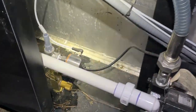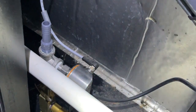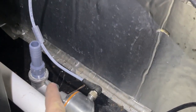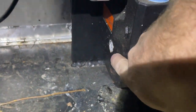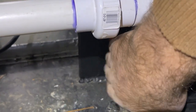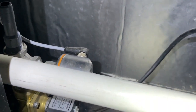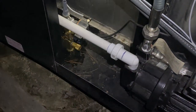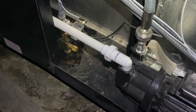I found — Justin Siegfried, thank you — he sent me these parts to order online. As far as what the actual original fittings are, I'm going to try this — it's a half inch MPT here. I took that brass adapter out and this seems like it's smaller, maybe three-eighths or maybe it's metric, I'm not sure. I'm going to take this adapter to town and see if I can cross it over to a hose barb, and then just run a piece of flexible tubing for now, at least to get me up and running. Then I'll see about ordering the original parts — I want to keep it original as much as possible. Probably order the originals and a set of spares also.